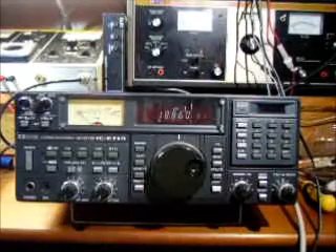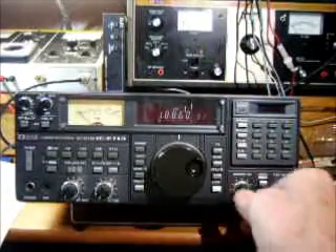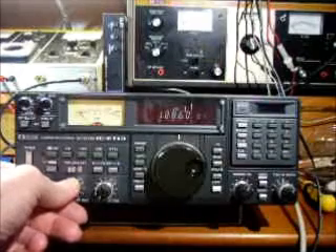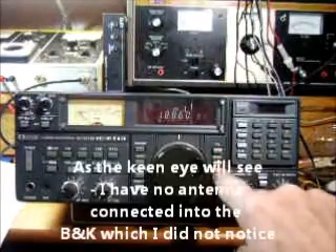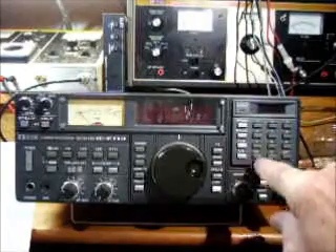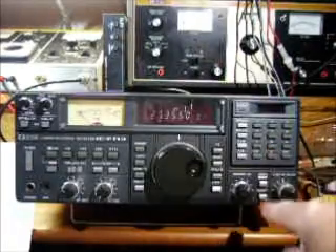After the initial power-up, the system must initialize the RAM settings. We have the original memory frequency displayed. I have an antenna plugged in, although it's a 27 megahertz antenna. We'll go through the initialization procedure as instructed. It says to put in a valid frequency with the numeric pad. Let's put in 27.355 megahertz and enter it, then select the mode, which is lower sideband.